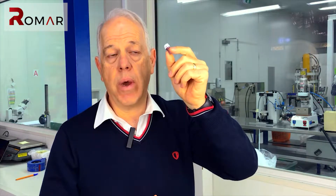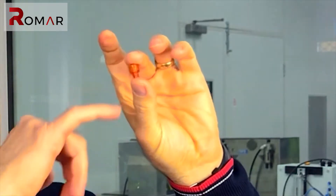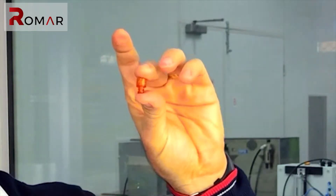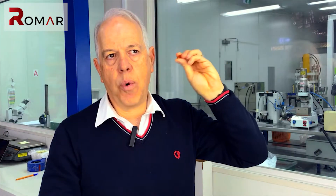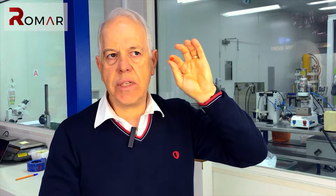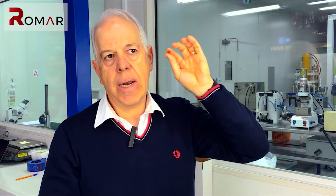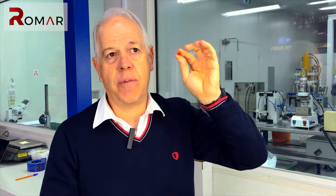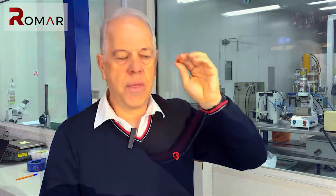The Q-Flow is made up of five different components, both silicon and plastic. This is one of the plastic components — it has very tiny features, a little band where the silicon o-ring goes, and very tiny features inside. The whole point of micro-moulding is that all these features are critical, because accuracy leads to the successful use of the device — working first time, every time.